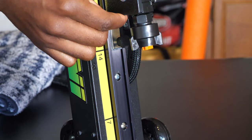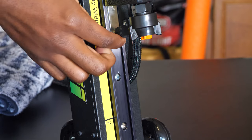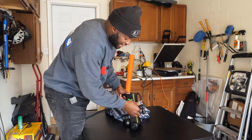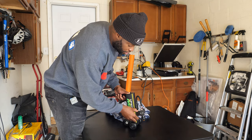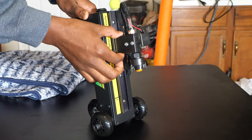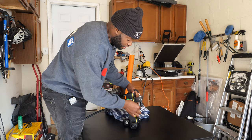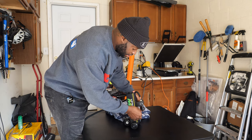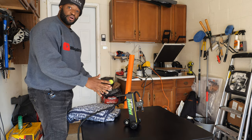Right here in the front of the Viper Mini there's a knob. You can turn this knob — let me tighten it up first. Tightened up, the sprayer nozzle is right here on the tip, and tightened up you can't move it. But if you twist this knob counterclockwise, you can now slide this sprayer up and down this rail. The closer you put this down, your solution is going to spray close to the shirt. And if you put this up, it's going to have a wider spray. So we're just going to play around with it — I'm going to put it right now at medium distance, about to the number 14, and then tighten it up. Now that I've tightened it up, you can see that this sprayer is not moving anywhere.